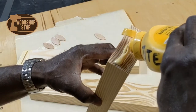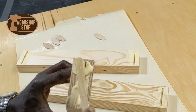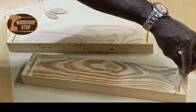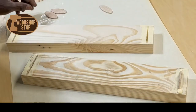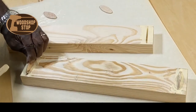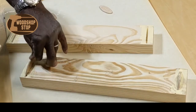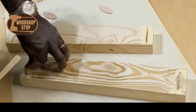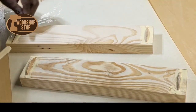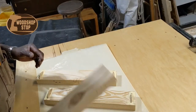It's a really nice way to do a simple project like this with the biscuit joiner and gluing up the biscuits in the joint. Otherwise you just have a butt joint and it wouldn't hold up to any kind of weight — somebody leaned on it and it could pop. But these should do well. That one's a little snug — it might have had some dried glue left on it from a previous project.